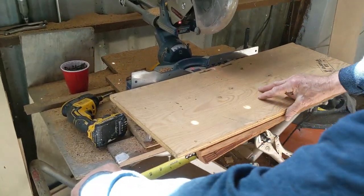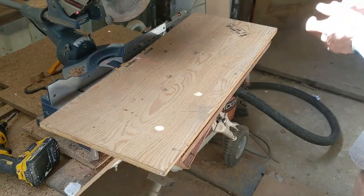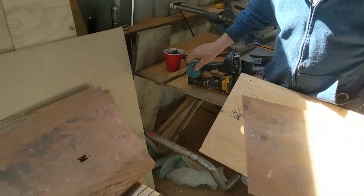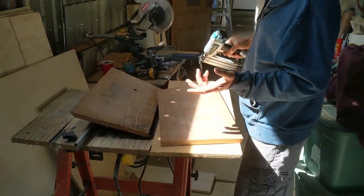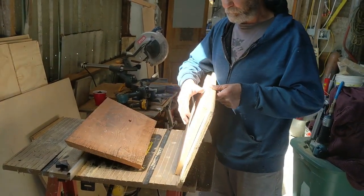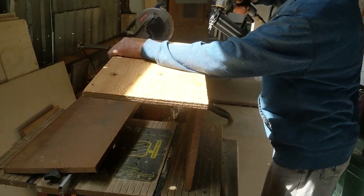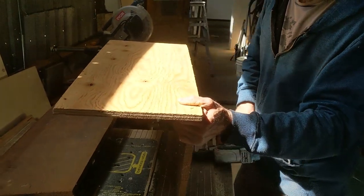Two and a quarter, and here I have about the same — I can make a little mark in there. This is the back of the box. I'm not gonna go too crazy about it. Let me just use this one here — the table saw is a little bit easier. I'm just gonna use the nail gun, just to put a few nails, and then once the assembly is complete I'm just gonna screw it up. Once I have it right where I want it, like you guys can see — no need to mark. The nail gun makes life a way easier. Then I put a few nails in there just to hold it in place.